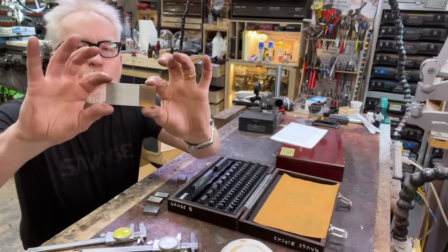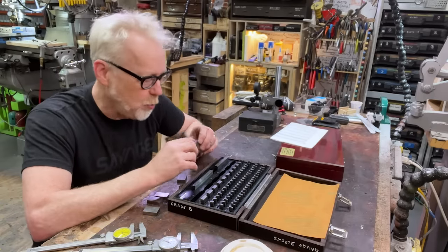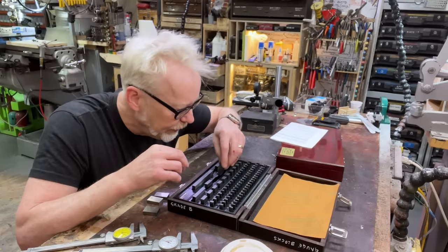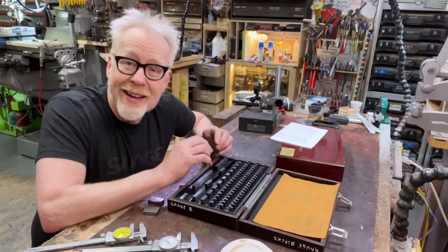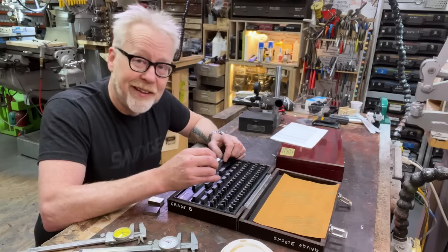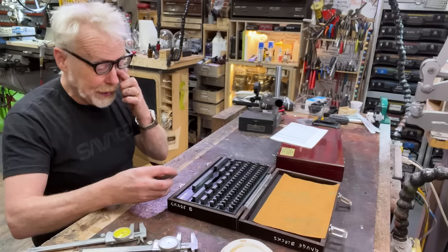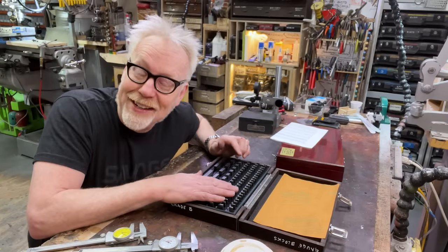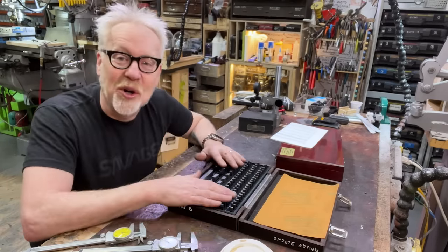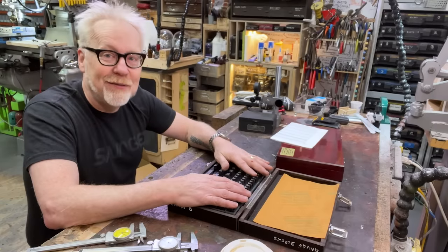The thing about gauge blocks is when you ring them together, the distance between the two blocks is reliably 25 nanometers. How do I give you scale on 25 nanometers? Twenty-five nanometers is about the distance your fingernail grows in about 30 seconds. There's a genius online — a guy who read that your fingernails grow one nanometer per second, actually came up with a measuring protocol, let them grow, and determined yes, give or take, they do grow about a nanometer per second. Which means they grow about a meter every 27 years.